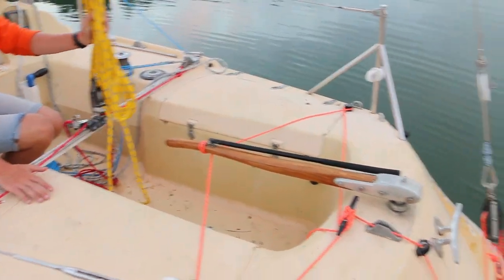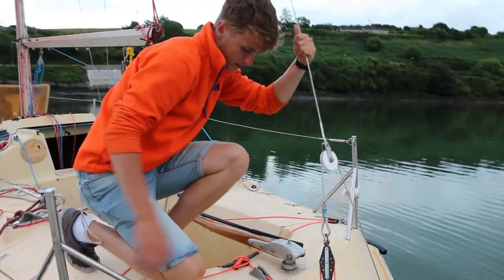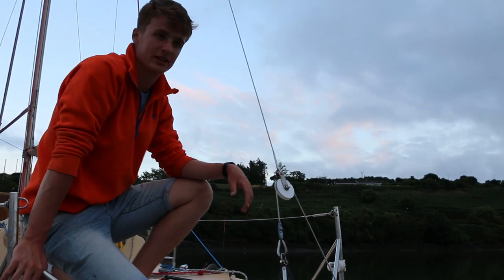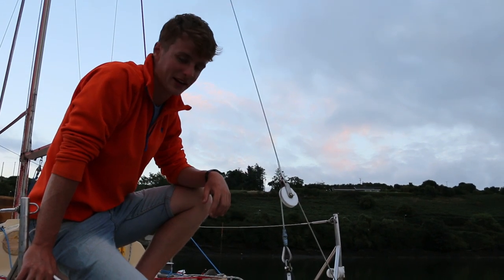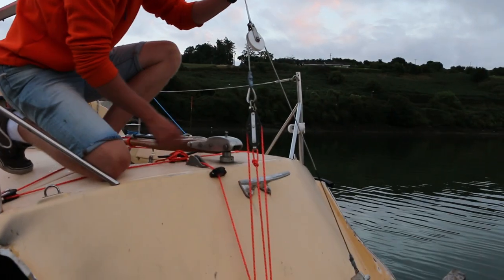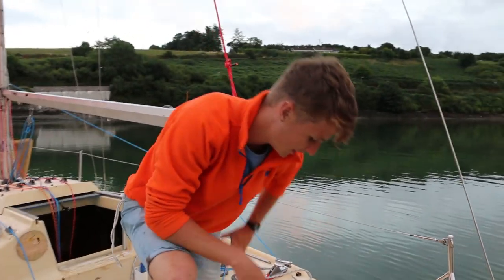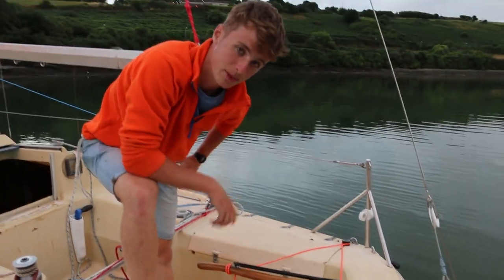I've got a nice double purchase system on the backstay — I'll show you that in a minute. The backstay isn't really structural as far as keeping the mast up, which means it's more useful for sail trim. So if I'm finding my jib halyards a bit loose I can just take on a bit of backstay without having to go forwards when I'm singlehanded. Double purchase system through this cleat and onto this cleat. For now I'm using what's left of my uphaul to keep my tiller in the middle, until I get an elastic from that D-ring to that D-ring to keep it straight.